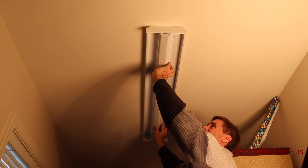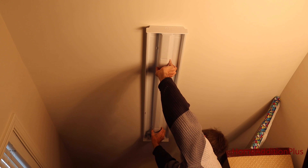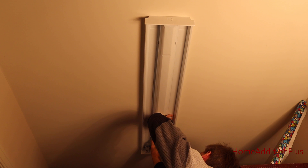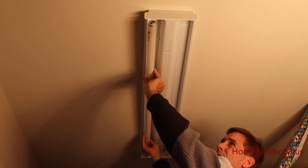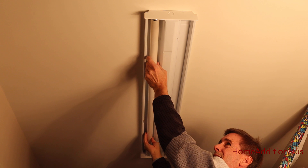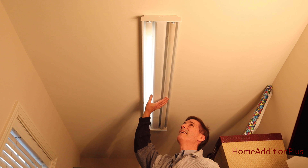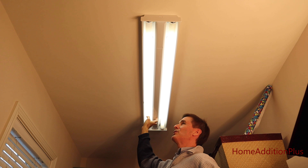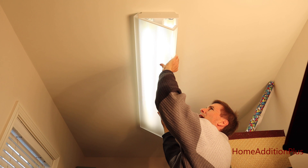I've got the metal cover to hide the wires and the ballast. Just going to squeeze it a little bit and it'll slide underneath the tabs, just like that. We're ready to put the bulbs back in. Just push them up in place, rotate them, make sure they're locked in. We'll have the switch turned on — and the lights are now both working. That ballast is doing its job. Now with this light working, we're just going to put the cover back on to wrap up this project.